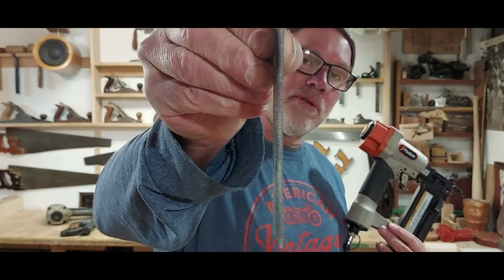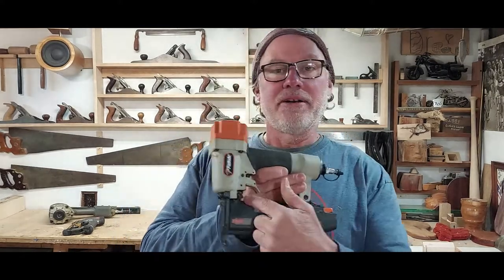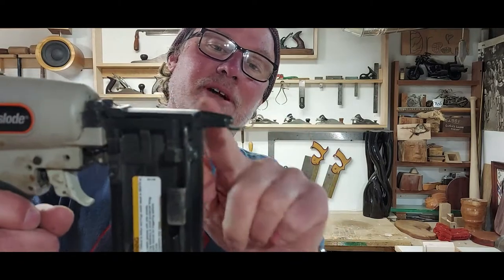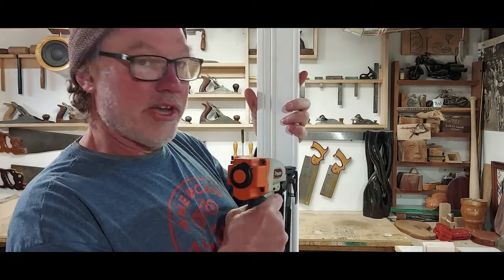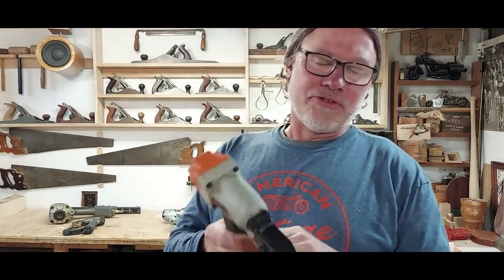This is the 18 gauge. This is a clip of the 18 gauge nails — as you can see, they're just a little bit smaller than the other nails. On this gun, it'll shoot probably about an inch and a quarter nail down to about a half inch nail. So obviously it's not capable of shooting the big two and a half inch nails, but that's okay for what you use these for. And it's because of this tip — the safety part on it doesn't encompass the whole tip, so you can see it a lot better. If you need to nail a piece of casing and hit the jamb with only three quarters of an inch, you need to know exactly where that tip is. That's what makes this gun a little bit more accurate to shoot. Even though those nails are a lot smaller, they hold tight.